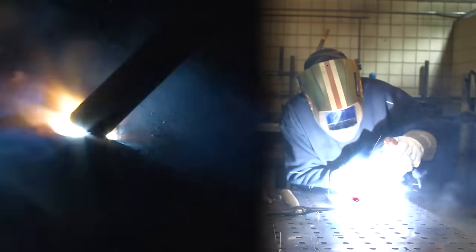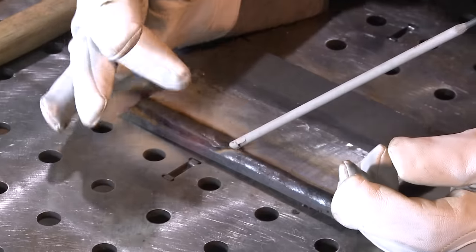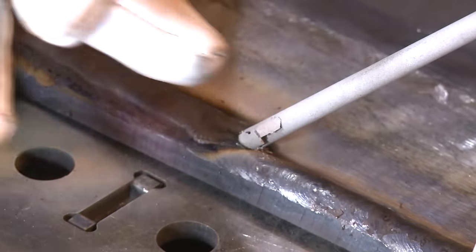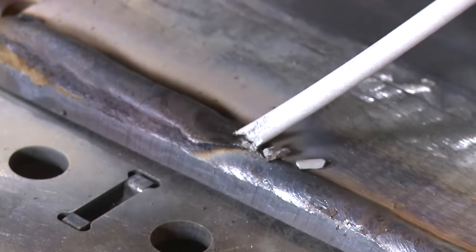The whole weld pool — I'm barely touching the plate. I can feel the plate. Welcome to stick welding. I can see what happened here — I've got a big crack in my slag, it just kind of fell off. So I've got an electrode that's not good.